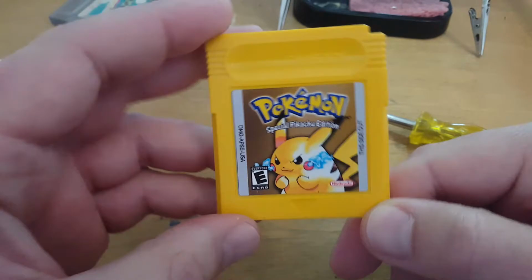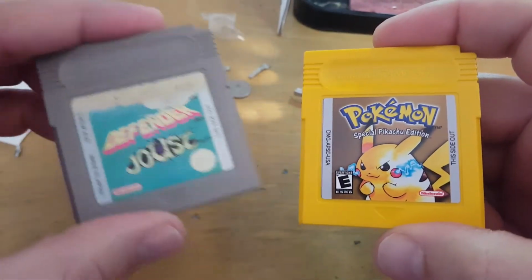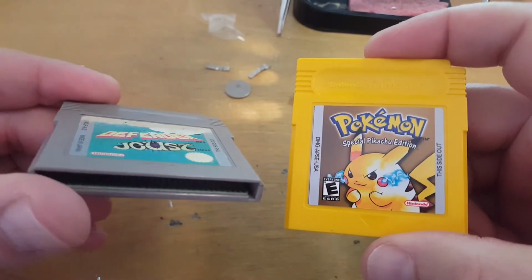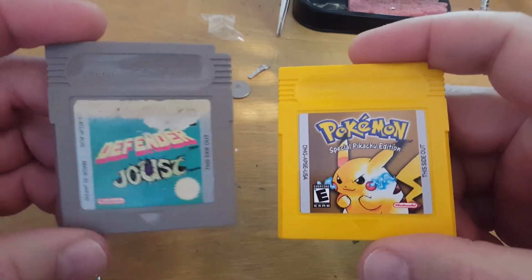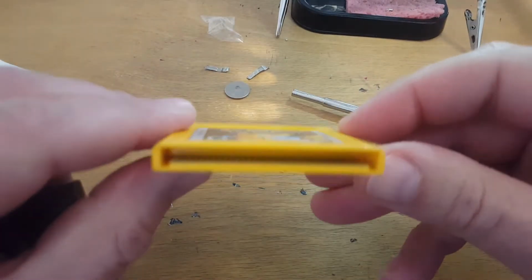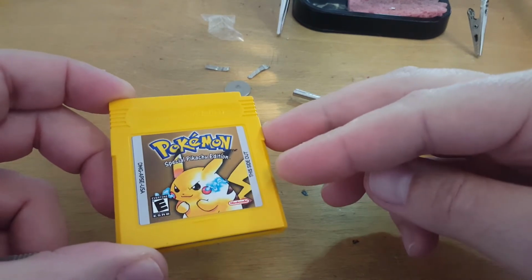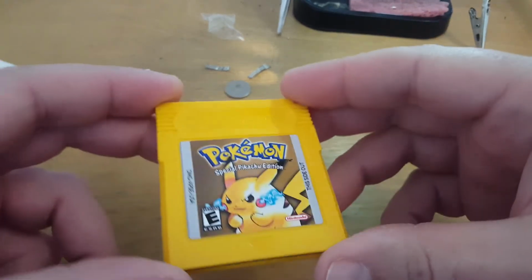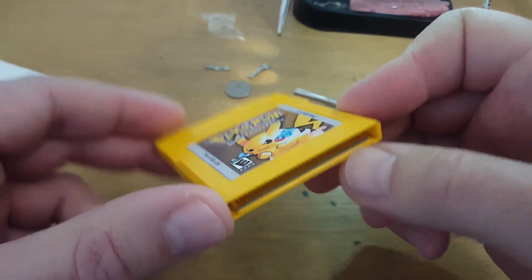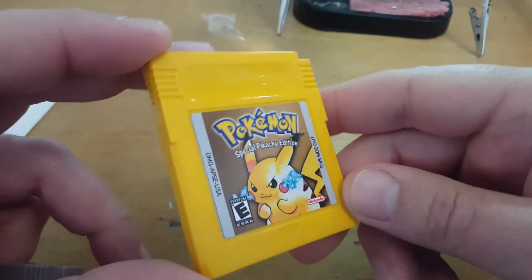A bit down there. But yeah, so this would have improved the gameplay on this one anyway. Just improving those connectors for the cartridge or game pack. And now this one's sort of definitely improved itself. Now got a better battery in it, a new battery as well, soldered in properly, clean the pins, the connectors, clean the casing, new sticker, and it's ready to go.